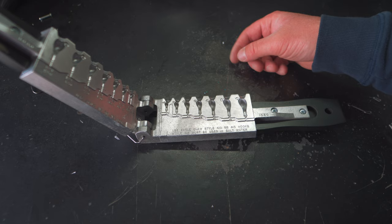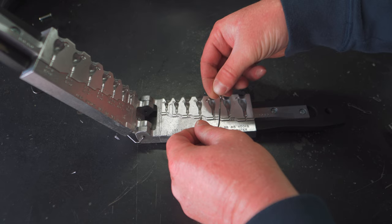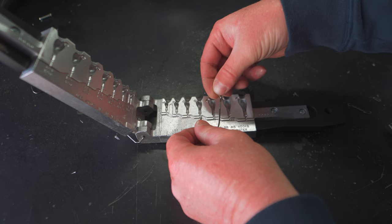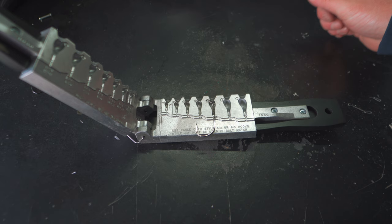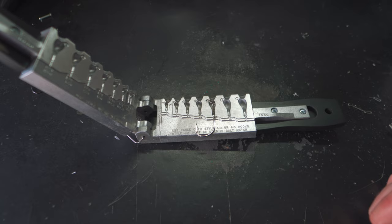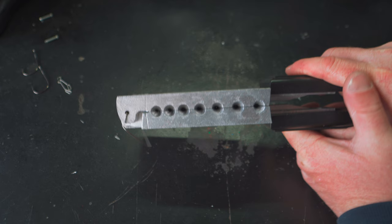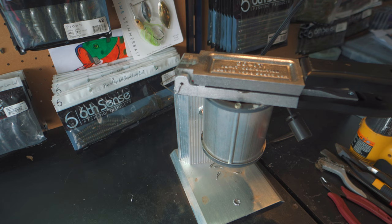You don't need a long area hanging off — you just need a little bit that's going to come up right next to the hook. That's what you want the wire form to look like when done. The first chatterbait we're going to make is the three-eighths. We need to take our wire form and set it into the eye of our hook, then set it into the mold. I like to put a wire keeper in these — this is the WB400 wire form.